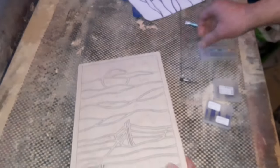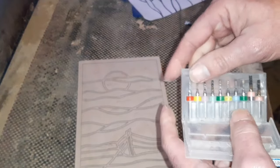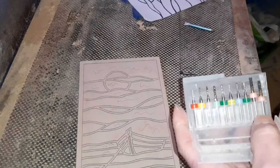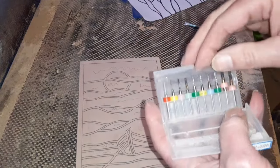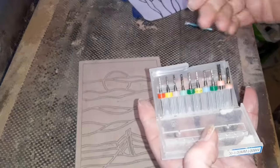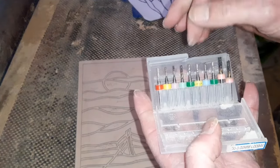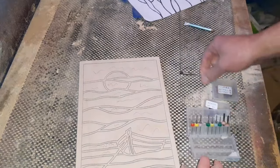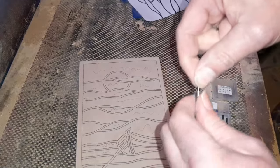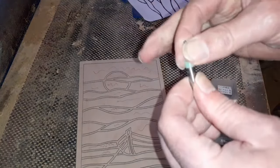Once you've done all that, we'll pop on an end milling bit. Now remember, there are different bits out there. There's spiral up cut bits, liner bits, profile bits. Find one that suits you. But for me, good old eBay or Amazon. CNC bits for the lines. End milling bits for the router now. And you can get one at a nice size. And they fit the same adapter. They have the same shaft on. It's 3.175 millimeter. So we just slot that into there.